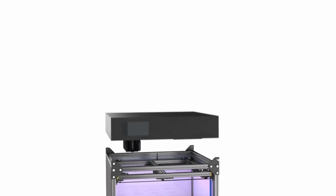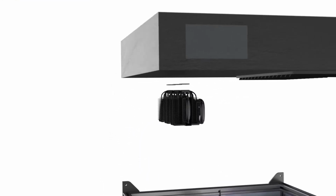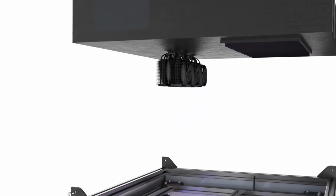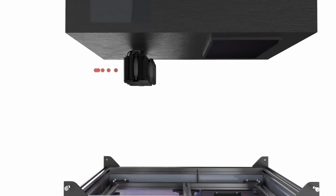Temperature is regulated by the control module through a thermoelectric heat pump, which can both heat and cool depending on the supplied polarity. Fans blow air through a heatsink adjoined to the heat pump to maintain a desired temperature inside.